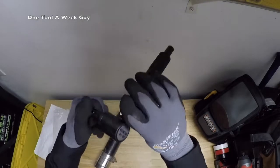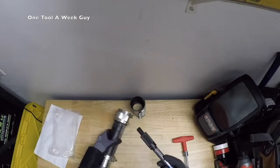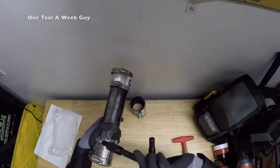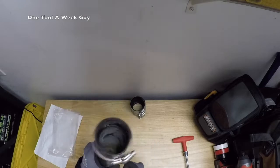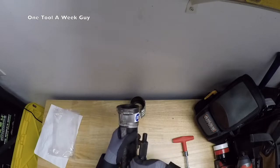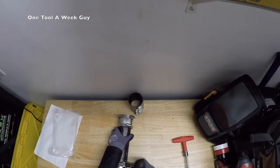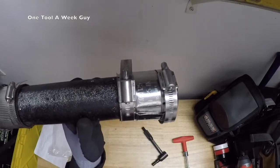Of course, one side is going to have ratcheting and the other side is for loosening or tightening the clamp-on. It's also going to be a 5/16. So we do a quick tightening right there, and then we pull it off and put it on the torque side — once it reaches 125 pounds you'll also hear a click. There we go — you've got your 125 pounds to assure a leak-free joint.